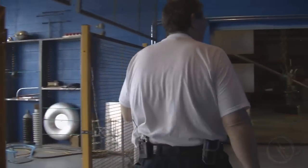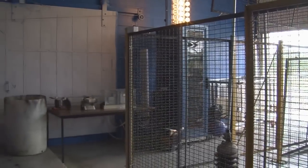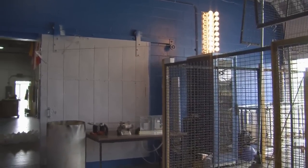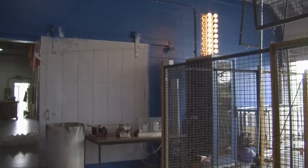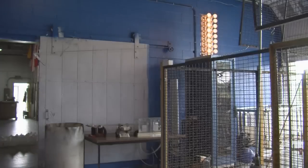Who's going to step on the switch this time? I think Mikey should do it this time. Okay, we'll let Mikey. You'll notice the lights on the top. That's something that we changed last time around. That is the load resistor to charge the bank. When you first start charging the bank, the capacitors read as a dead short. So the entire voltage that we're feeding in gets eaten up by those light bulbs up there. As the capacitor bank charges, the bulbs get dimmer.